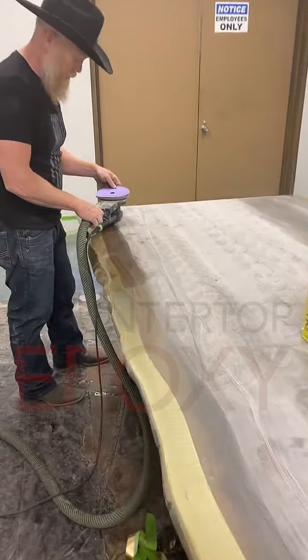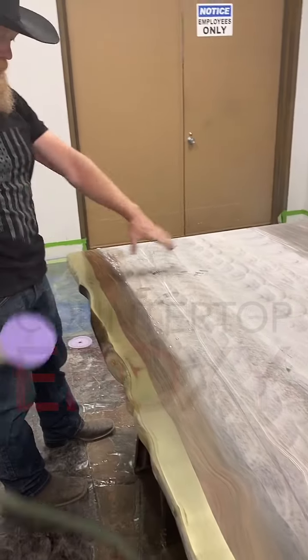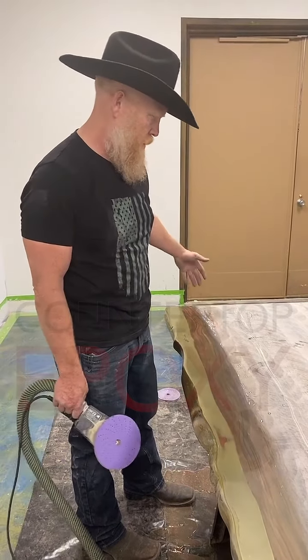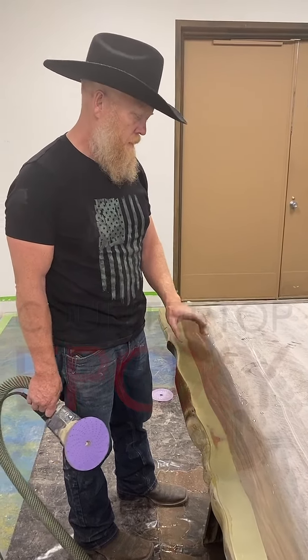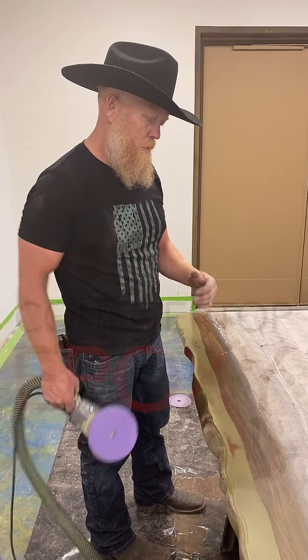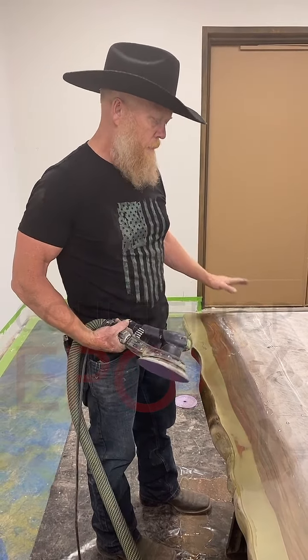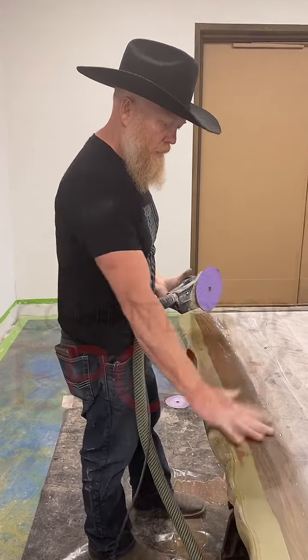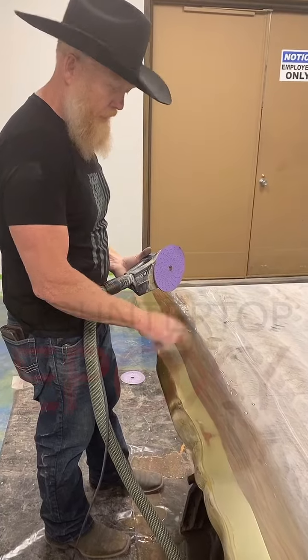You know what, I'm going to show you guys our wood grain too, because the way we do this is we pour all these colors on here and it just looks like a big mess, and then we scrape it with a scraper, and there is a video coming out on how we do this. But then the real pattern comes through when you sand through the top layers and you kind of expose what you scraped down below. So this end, I'll finish and I'll show you how to polish the fake wood grain and how to polish this brass bronze as well.